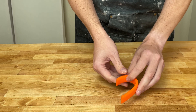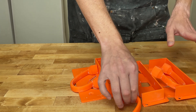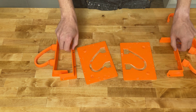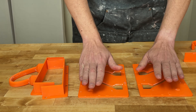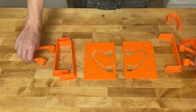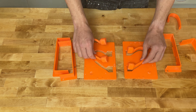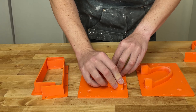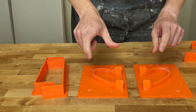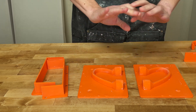Here's the handle form, and to make a mold we need all of these pieces. There are two bottom plates - this one ends up being the face of the plaster that mates together. There are two recesses for the mold of the handle shape itself, and a little groove where the handle piece fits down into. That groove is one of the reasons why these handles are a fixed size - there are some really tight tolerances there. If you wind up stretching this, it will probably break, so definitely not recommended. I've had some people try to resize the molds and it doesn't work.